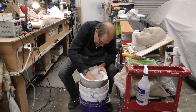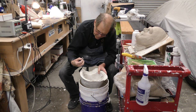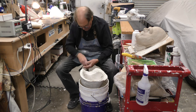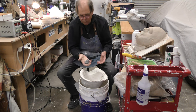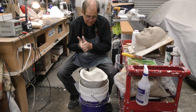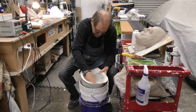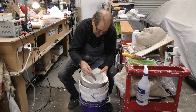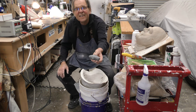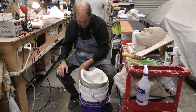And that spot there looks like a damaged area. I'm going to find out if it is or not. I'm pressing clay into the mold. No, it's fine. It's just a discoloration. In fact, remember I talked about sculpting backwards? Well, this is water-based clay, and this is how you do that. Push it into the mold like so. So if I wanted to check the brow, there's the brow. And I can look at it and say, all the details are there, everything's fine.